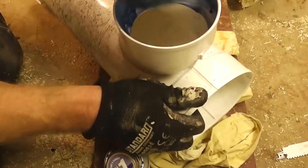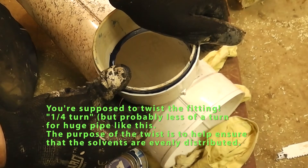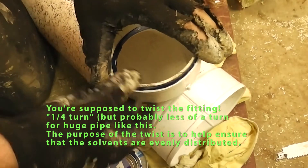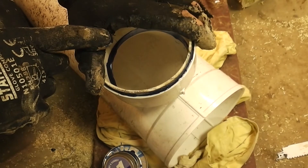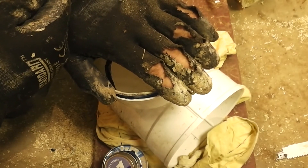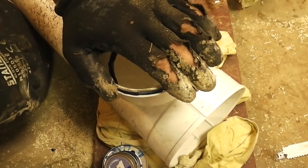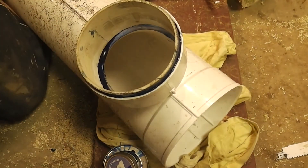Let's see if it jams together — it does, no problems. Hold it in for a little while. I'm supposed to twist it around a little bit and it's still a little wet, so fortunately I wasn't screwed there. Sometimes, especially with heavier duty pipe, it does want to push out of the socket, so better safe than sorry — hold it in. It's not like 75 PSI, it's pretty much 0 PSI, so not that critical. Super strong bond here — just need it waterproof. Definitely going to let that sit a few minutes.